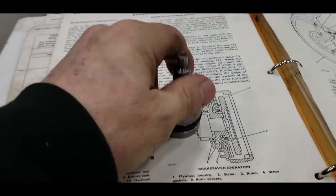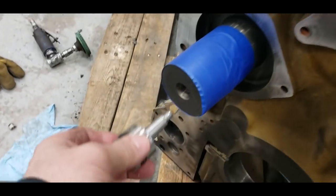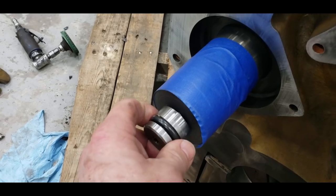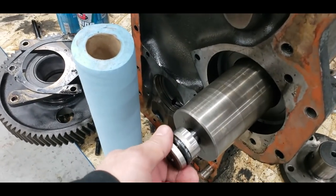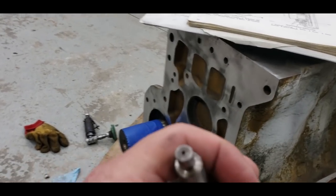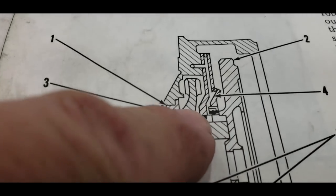This is the piece that was in the flywheel cover, and this is where it would go when you put the cover on. It goes up to the center of the shaft. Because this isn't a retarder machine, it has that ball in there. But on old Kenny over here — it's a retarder one — that ball is not in there, so this fits in there quite snug. I do have to get that ball out, because this device right here supplies lubrication oil for this rear seal.